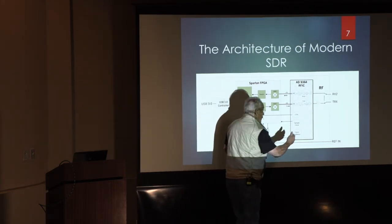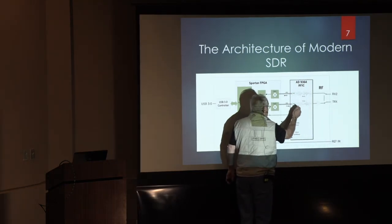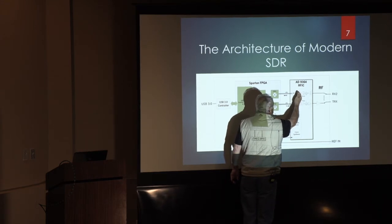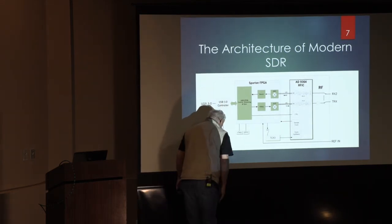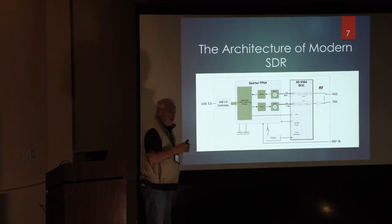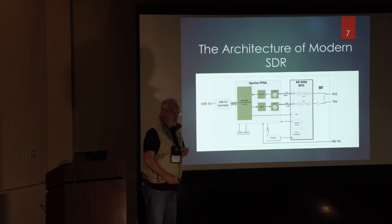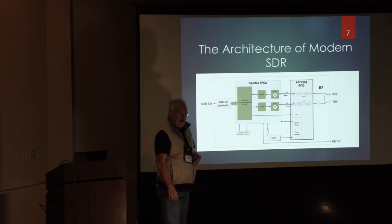The analog starts out at your antenna, comes in here, hits the analog-to-digital converter on the receiver, and it becomes digital — and you're in the baseband doing some of the DSP before going into your computer. I struggled with this for a long time in younger years: where does the digital signal processing start? In this block diagram, the digital signal processing starts right here in the FPGA.